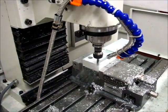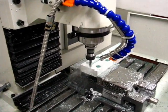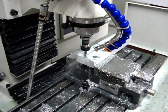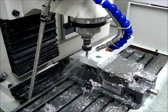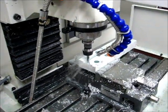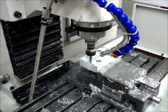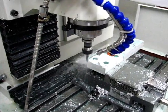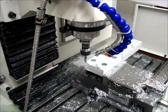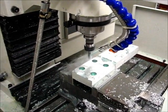Alright, the hole finishing operation is complete. The chips cleared out very easily with a quick blast of air — no problem at all there. Now I can't do a trochoidal path on this because the parts are too close together. As a result, I'm using full width of cut — full tool engagement on this, which I'm not happy about. What I did is actually set this at 40 inches a minute — too fast. I'm not satisfied with the sound it's making, so I slowed it down using the Mach 3 commands. I slowed it down to 70% speed.